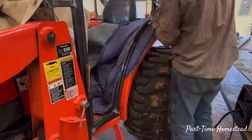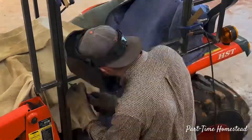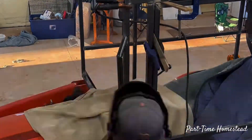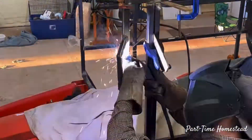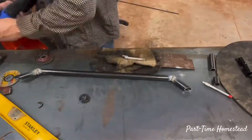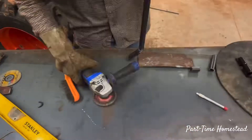I used a pump jack jig to help form around the wheel wells using 1 inch by 13 gauge round tubing. That worked really well — I also used that same round tubing for the handles to get into the tractor as well as the door handle.